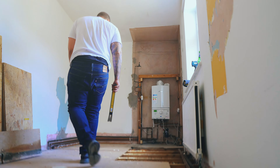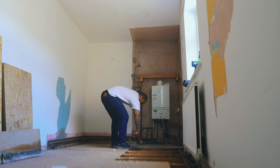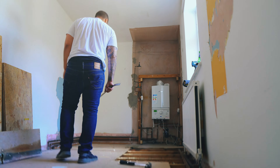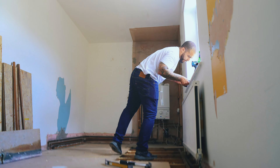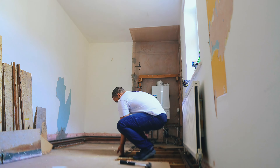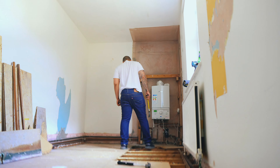It was a whole task — I'm speeding through it, but this took a lot of hours. Getting these floorboards up was a pain because half of them were nailed in, half were drilled in, and some were nailed AND drilled in. Some of these nails you couldn't even get to — that's the thing about a nail gun, sometimes it buries the nail so far in it's near impossible to get up. A technique I learned: lift the board to pry up the nail, drop it back down, then get something to pull the nail out.